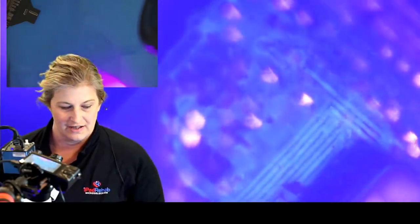So we're going to try to put a multimeter in here and see if we can pick up the actual good diode mode reading going back to the CPU. That's the connection spot. We're going to have to do some kind of trace repair on that spot right there. That's my guess. All right, I've got my UV light propped up, so let's hurry and take this measurement.